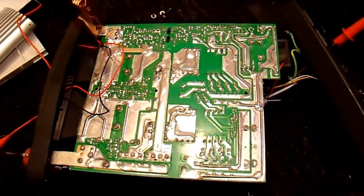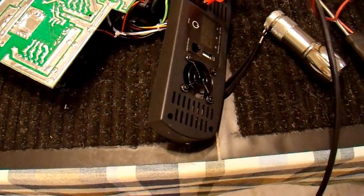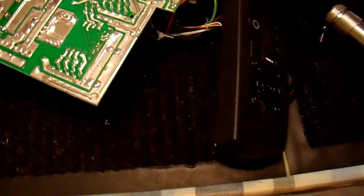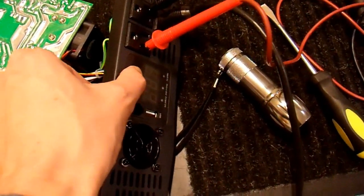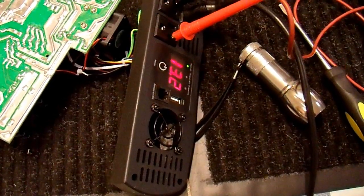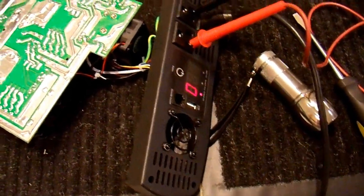I have the second inverter here — the one I just showed you disassembled, still disassembled — on the same test setup I used on my other inverter once I repaired it. I replaced two of the four transistors: two of them were bad, two were good. I just thought I'd show you that this inverter is much different than the other one — it behaves a lot differently in many ways. The circuit board is completely different. The case is about all the same really; the fans are different. On the other inverter you push the button and it turns on. On this one it doesn't do anything — you have to hold the button in to turn it on. Still draws 0.6 amps under no load — that part is about the same.